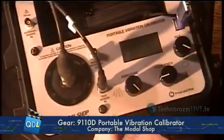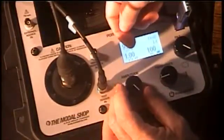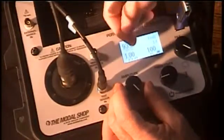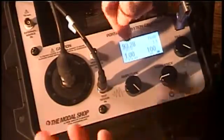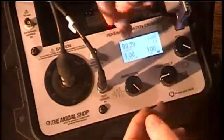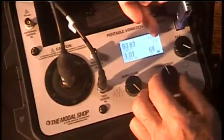On the 9110 here you'll see on the left-hand corner we've got an adjustment for the amplitude, and I'm going to adjust this for 1g peak. We do have the ability to use other units — this happens to be g's peak; there's also g's RMS, meters per second squared, and probably half a dozen other unit types. For this particular test we're going to use g's peak, and I've got my frequency adjust over here — I'm going to run down to 10 Hz because that is the first test frequency they use when calibrating this unit.